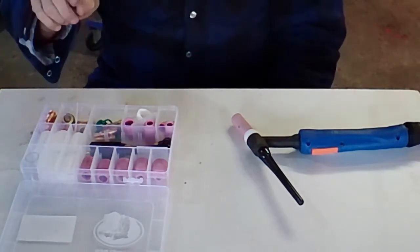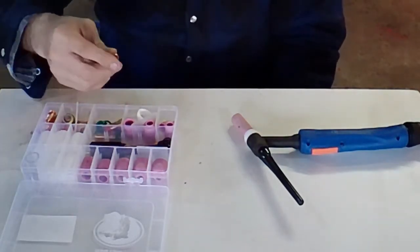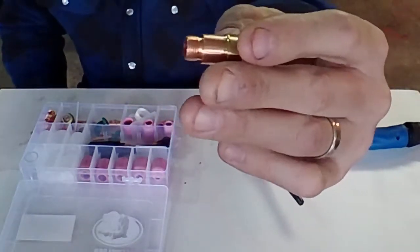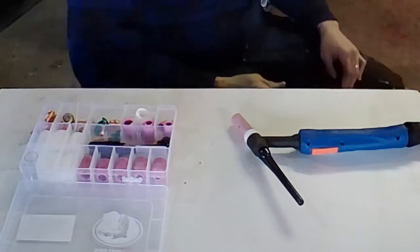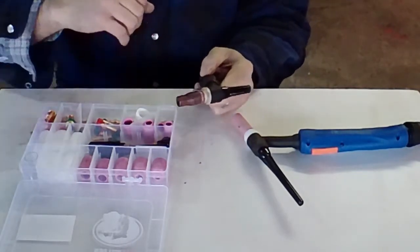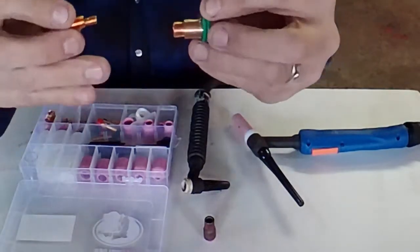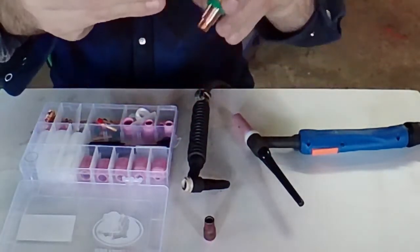Before I do that, make sure what you're buying fits for your torch. You can see the gas lens has a pretty fine thread — I already tried it on this gun and it's a direct fit, very easy. This here is a Miller, I believe it's a lot like a CK, and if you take the collet body out you can see those threads are much coarser than the Yes Welder kit that it came with.